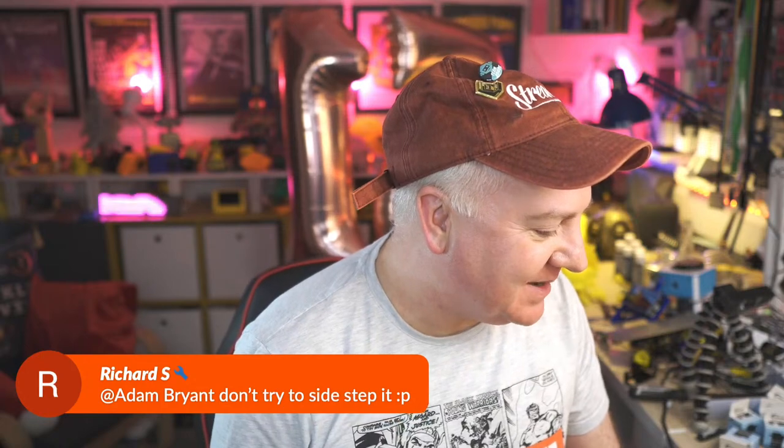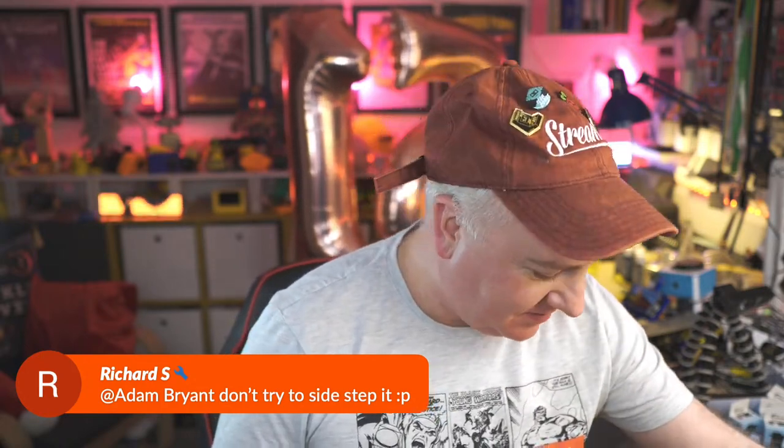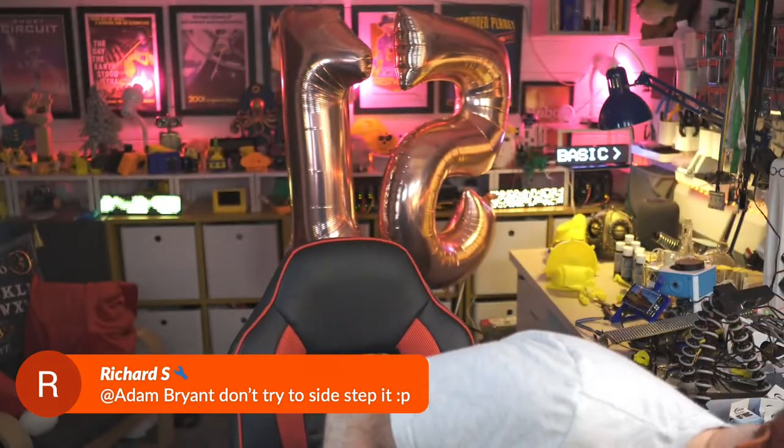So I was in two minds about what to do with, is that the thing I dropped before? I didn't drop it, it fell off. I've been playing around with these Theo Jansen leg mechanisms, and this was just a little prototype because it was quick to print. That bit stays still, and there's a little piece that rotates round, and that makes the leg mechanism do its thing. I'm going to have a couple of these, maybe two deep on each side of a robot, and it'd be able to move and turn depending on which way these go. They don't really make sense if you've just got one of them. You have to see a few of them in motion, but they're pretty neat as a mechanism.